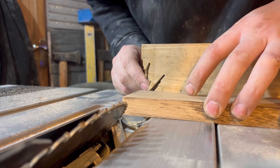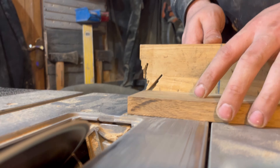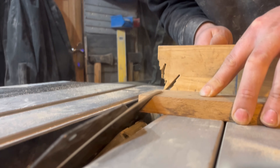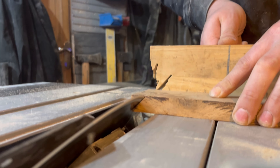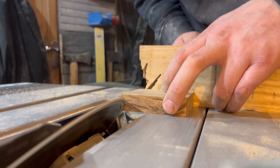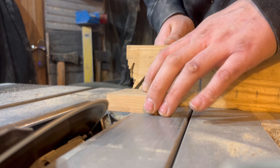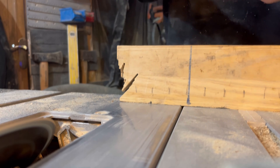To get back to what I was saying — I shouldn't have cut those smaller pieces out first. I should have cut the miters in them while cutting them out, because when I put it on my cross-cut sled I need a new back plate — mine has a very slight taper. You can see where that blue line is: I put that there to tell me not to push material past that point because it's not 90 degrees to the blade. Anyway, we're cutting the 45-degree angles into it.